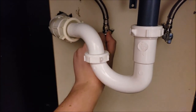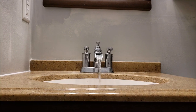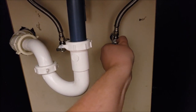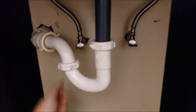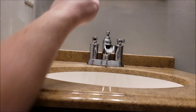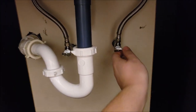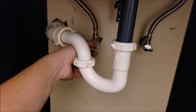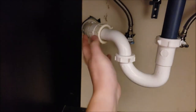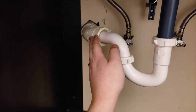We can turn on this side full blast and see what happens, then just a quarter turn — that should reduce the flow. A corner quarter turn for each valve should shut off all the water completely. I heard it stop, so even though both of these valves are open there's no water coming out because we shut it off here at the wall. That's very, very important — need to shut that water off.